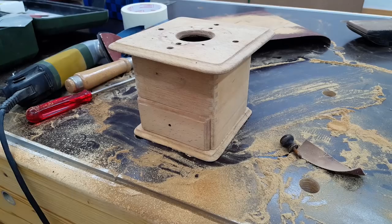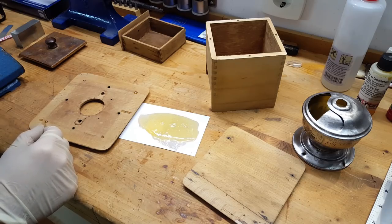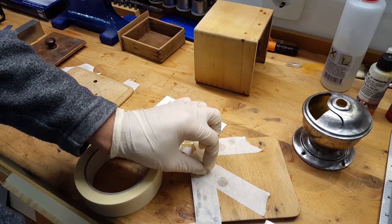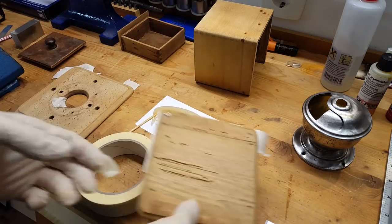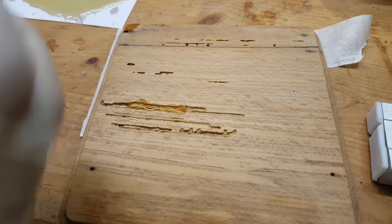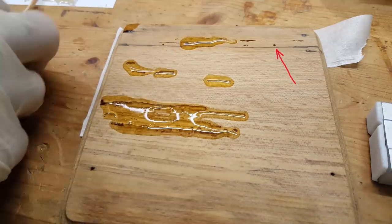This leaves us with the wooden body of the grinder. If you remember, we took care of any larger damages in the first video of this project and found out about major woodworm damage. So the first job now was to fill those in some way. For this, I again chose epoxy, as it wouldn't just fill the holes, but also hardens to a homogeneous combination with the wood itself, even stabilizing it locally. Filling the small wormholes worked great this way too, as the capillary effect sucked the resin deep into the worm channels. Just look at this spot, that I had to add some resin to a couple of times.